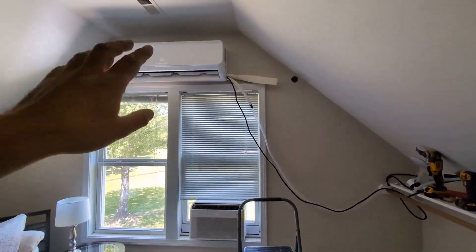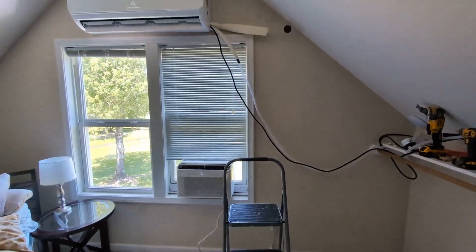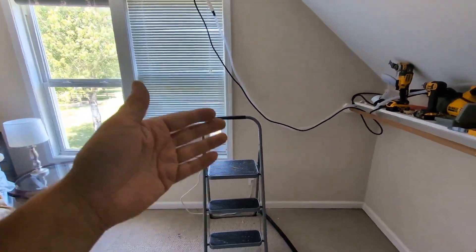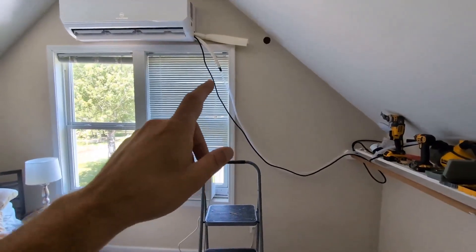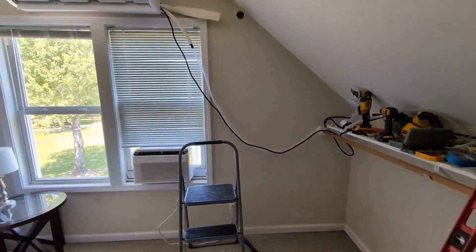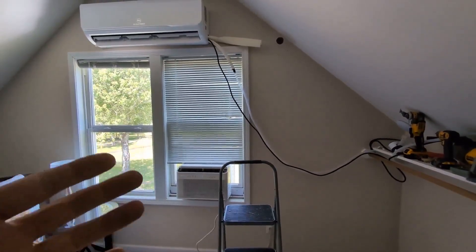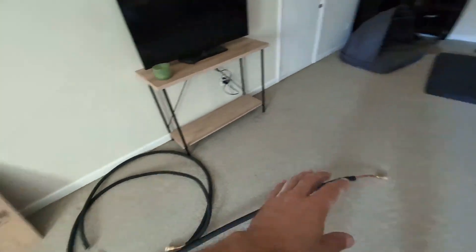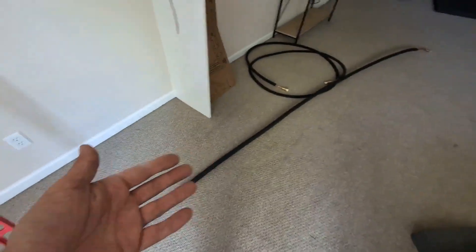So if EG4 is watching: make a version with a little bit longer line set, because technically it's not recommended to extend the length of those. And if you're extending the line set, you kind of have to extend the electric cord. The part that gets shady is some people will splice the cable — and because it's an exterior function, that gets dangerous. You really don't want people doing hack electrical work on DIY stuff. Making the device fit more situations than just first-floor options would be great. Even my downstairs garage unit, which is on the first floor, will need a little bit longer, so it'll have to be moved because of the inconvenience of this shorter line set.